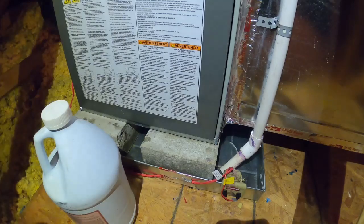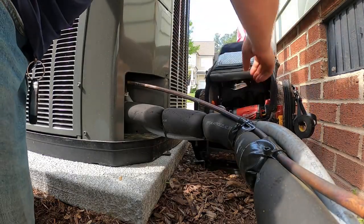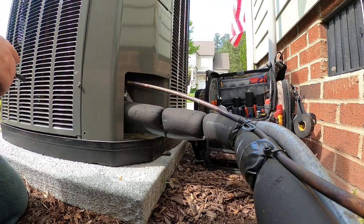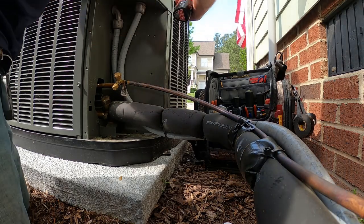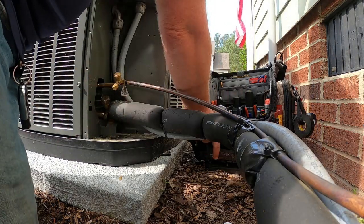We're going to run this thing, put the cap back, and our unit is on. Going to go outside and check the charge real quick and make sure this thing's draining before we leave. We're back outside — got that water out of the pan, drain line hopefully clear. We're going to verify that — a lot of people just do all that and walk away. I'm going to run this system until I get a stream of cold water out of that drain line. It's 82 degrees upstairs and humid, so that should not take very long.